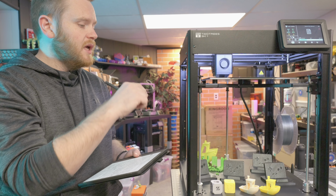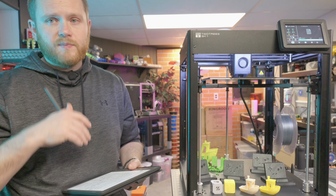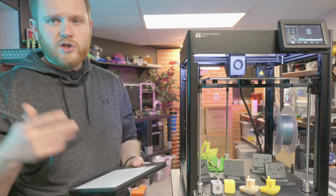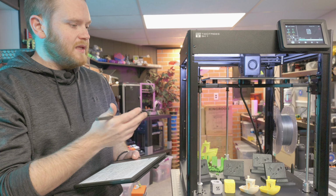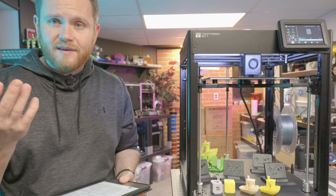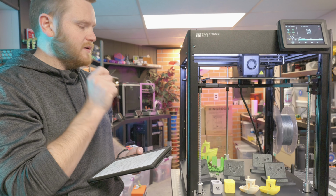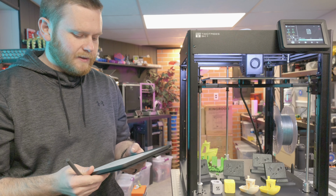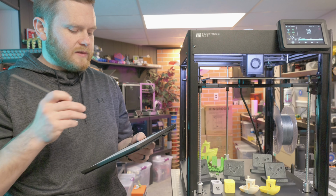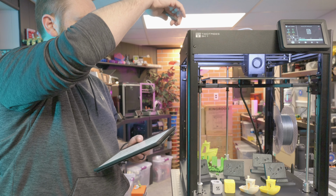This is a Klipper machine with a very capable MKS board. You could probably repin those fans and redo the configuration yourself, as always, fixing these things yourself, and make it dead silent and only turn on when you need to, because that's really easy to do in Klipper. But they did not do that, and the fans are always on, even when the machine is not being used. Just a missed opportunity.